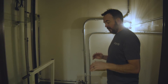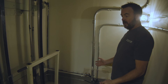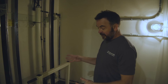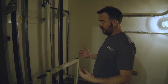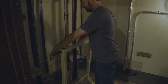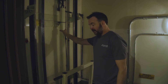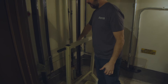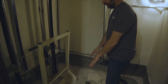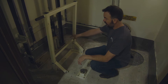Taking a look further into the pit, we have a 14-inch depression here. Talk with your architect or engineer as far as how thick the concrete floor needs to be. The majority of the weight for most instances is going to be right here on what we call the pit plate. That plate is where the rails are resting as well as the hydraulic piston. So the majority of the weight is all in that one position. If the car were to come down onto the buffers, some weight would be transferred to that location, but under normal circumstances it's all on the pit plate.